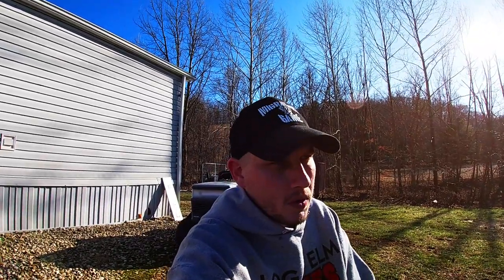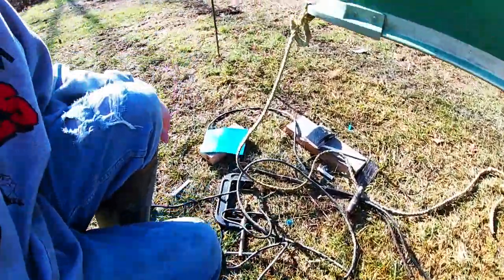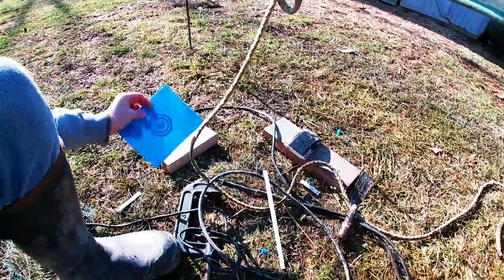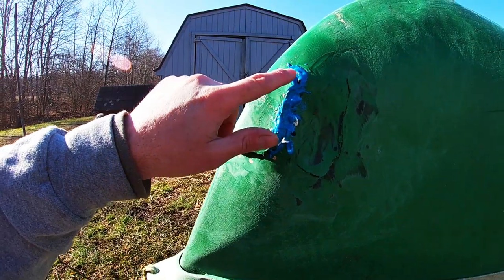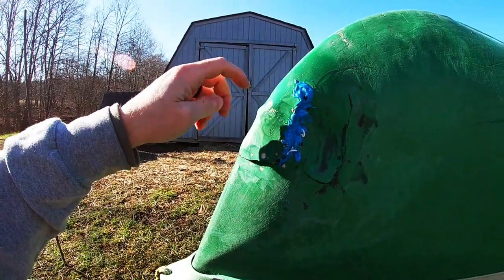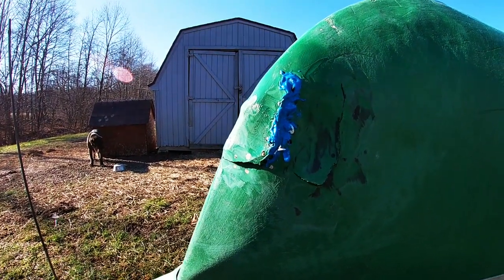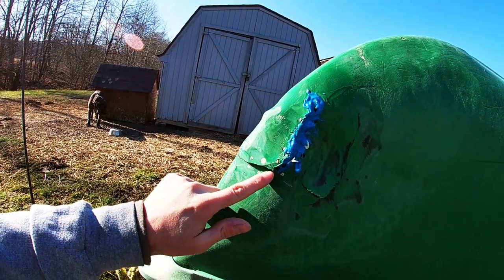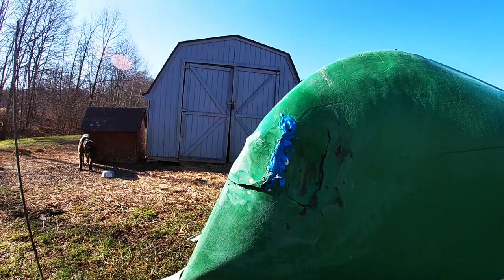So the mud flap wasn't really holding. But this is the bucket I bought to fix this anyway. I cut a little bit of it out and cut it into a strip — just a thin strip. And when I was heating the boat and that piece of bucket, they went right together and it's holding. That mud flap is definitely not HDPE. So I'm going to go back over what I've done on the other side, finish this weld up, and then touch up the other side.